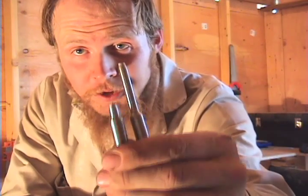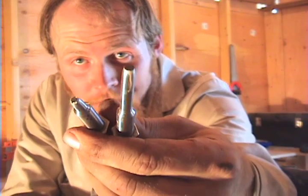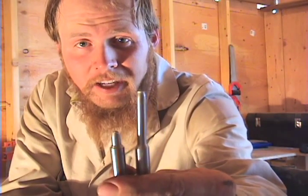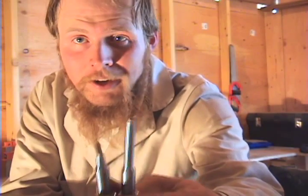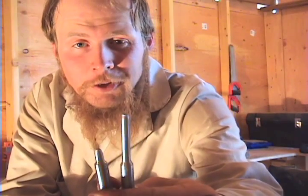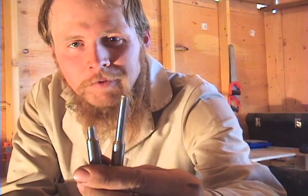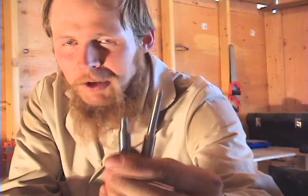There's what's left of our tensile specimen — classical cup and cone fracture, if you can see that there. Based on the pressure reading I was getting and the calculation based on the area of the cylinders, breaking strength was right around 112 KSI, or 112,000 pounds per square inch. That'll be some useful data for if I ever decide to use this titanium alloy for anything.